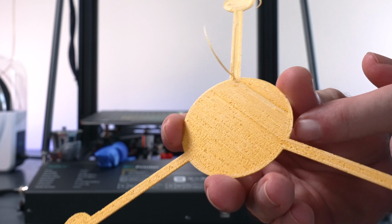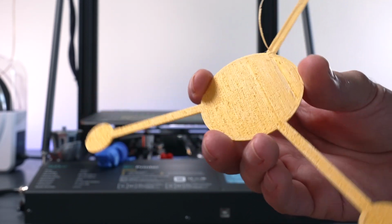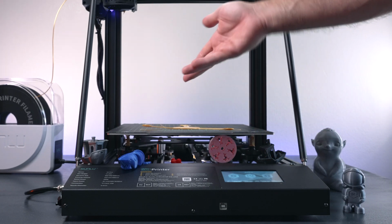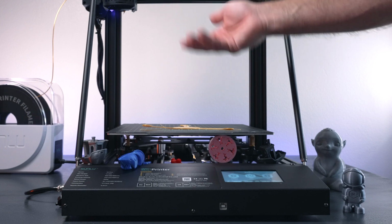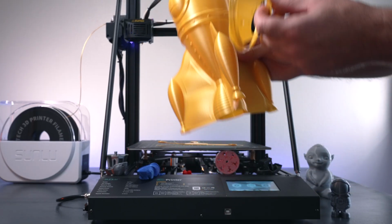And if I show you guys the bottom layer, you can see how it was printing. Like, it had so much moisture in it, it was constantly popping. And the reason I wanted to use this filament is because of the dryer box, to see if it can improve it as it prints. And sure enough, after a while, as the filament sat in there, it improved and started printing normal after about 2-3 layers. So unfortunately, we broke this whole thing apart.